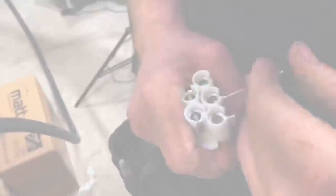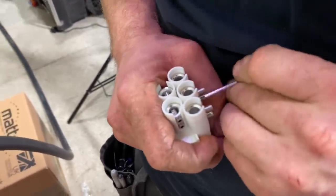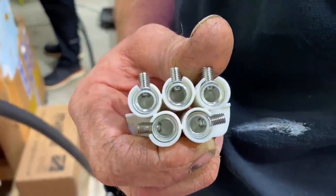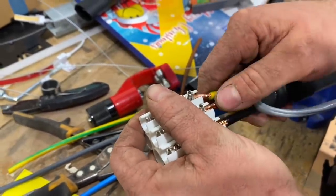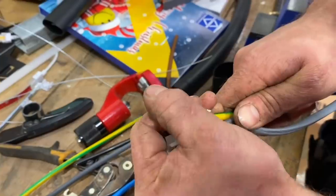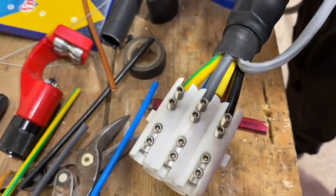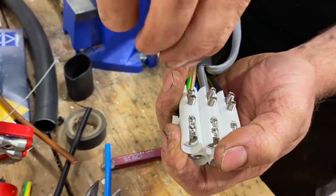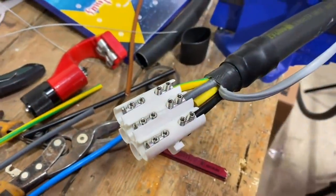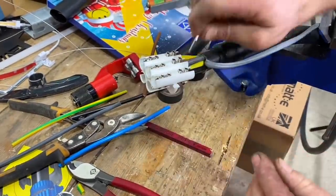Ross is going in with his favourite croppers to strip the conductors. The connector terminals have Allen key heads rather than shear-off bolts as you'd see on traditional mains make joints - these are conventional terminals. The Allen key comes with the joint, though you may prefer your own or a shorter one for better torque. We go round several times tightening the terminals because the conductors tend to settle, so we end up going around a few times to ensure a good, secure connection.